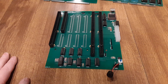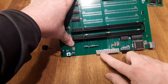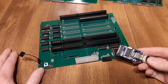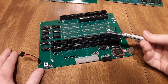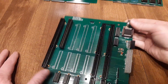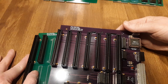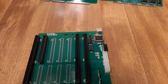There's a reset button and a 24-pin ATX socket. There's a little line that says 20 and 24, so if you had a 20-pin connector you could plug it in. The header for the USB — you just use a CH376 and then just a regular USB drive. For the keyboard, still using the WinBond — either the 82C42 or the 83C42 will both work, taking that it is built correctly.